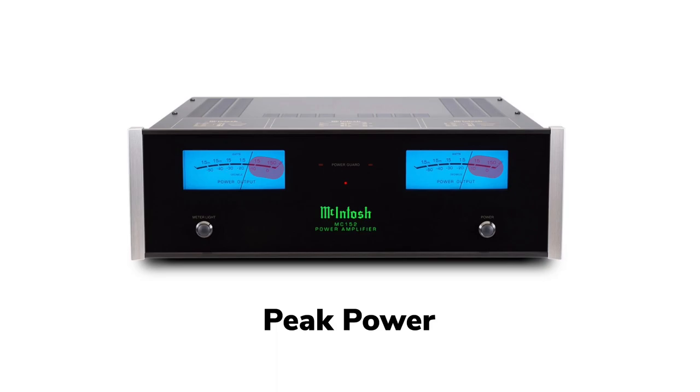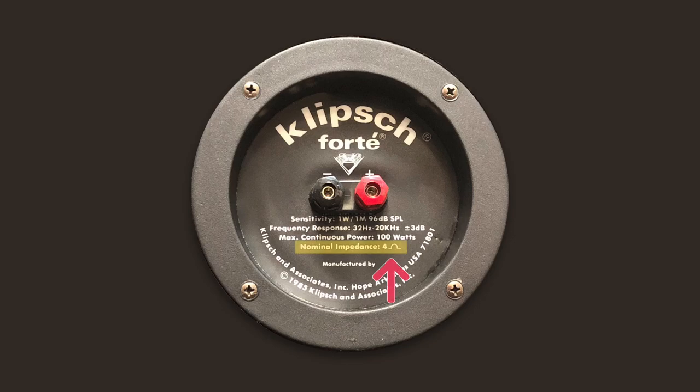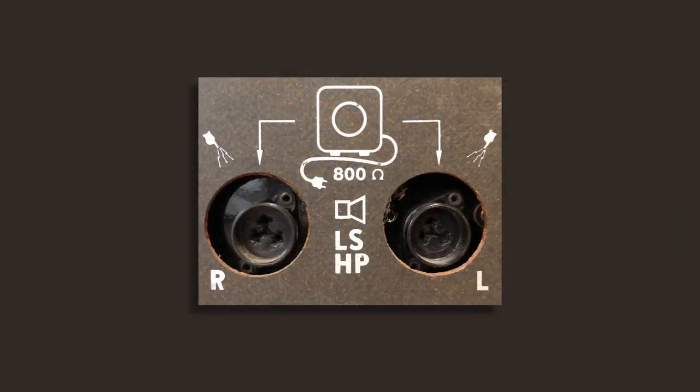It's only when music reaches crescendo-like levels that the amp will briefly be required to output 15 to 150 watts — this is known as transient or peak power, and the power a speaker can handle for brief periods is specified as its peak power handling. A speaker's impedance rating tells you how much electrical resistance it presents to the amplifier. Most home stereo speakers are rated for 8 ohms and almost any home stereo amp will work fine with them. Some speakers such as many Klipsch models are rated for 4 ohms, which also works fine with almost any high quality amp or receiver. Antique components, especially ones from the early 60s or older, can sometimes have atypical impedance ratings considerably outside the 4 to 8 ohm range, so you'll need to be extremely careful and make sure your equipment is a suitable match.